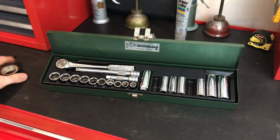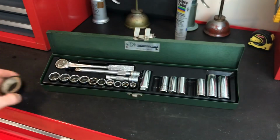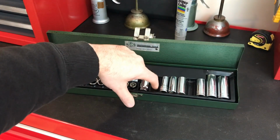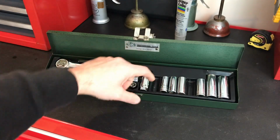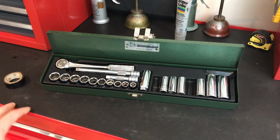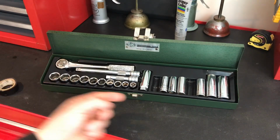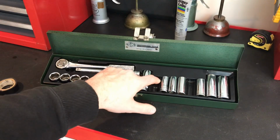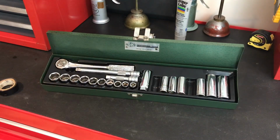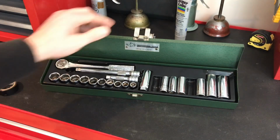So what I did was I used electrical tape to repair it. If it was a crack that was within the socket actual tray, what I did is I used alcohol, cleaned it really nice so the tape would adhere really well, and I taped it from underneath as well as on the top in certain spots, and it really reinforced it nice on both sets, and it blends right in. You can see there was a crack there and a crack there, and you could barely see it with the electrical tape, so I'm really happy with the way that came out.